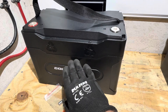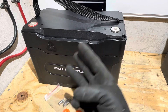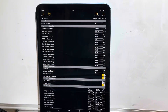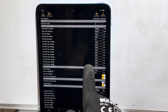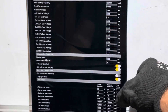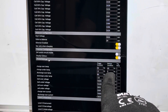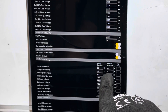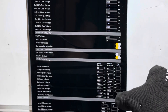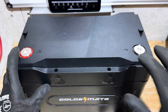The battery supports up to 4S series wiring for a 48-volt battery pack, or any voltage in between — two for 24V trolling motor, three, whatever you need up to 48 volts. Before the teardown, I want to show you the factory BMS programming specs. Charge over-temp is 55°C, release at 45°C. Charge under-temp is 0°C with a 5°C release and a 1-second trip delay. I'll scroll the screen so you can see all the settings.